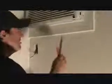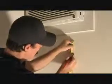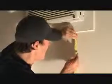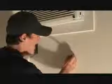Okay, so what I usually do, you can hold it right where the mark is, and get it pretty close. Now, if you want to get it perfect, you could burn an inch and hold it at an inch and then go down to 4 5/8. You know what I mean? Then you get it exact. And I'm measuring that, and it's actually 3 5/8. So I'm going to have to go down just a little. I'll measure this again. 2 1/4. And that should fit pretty good.